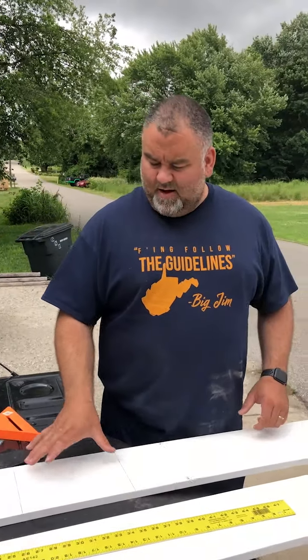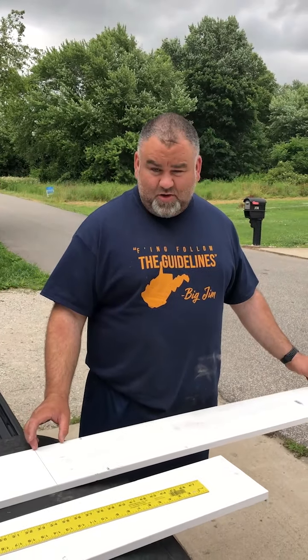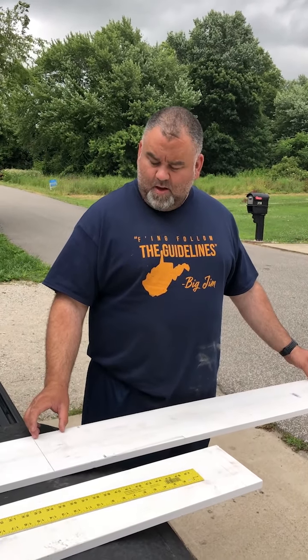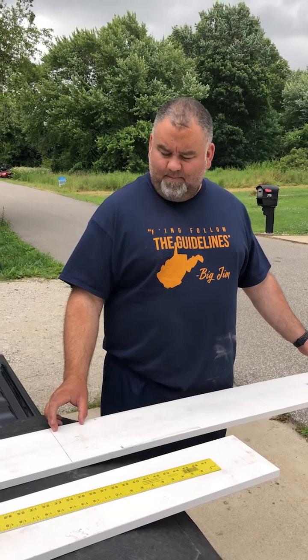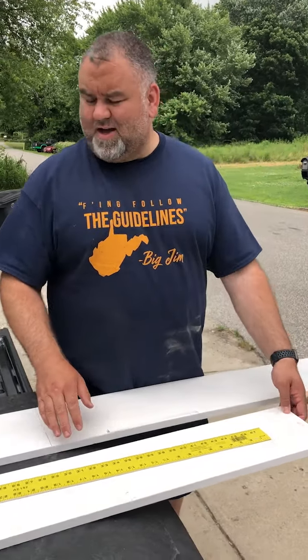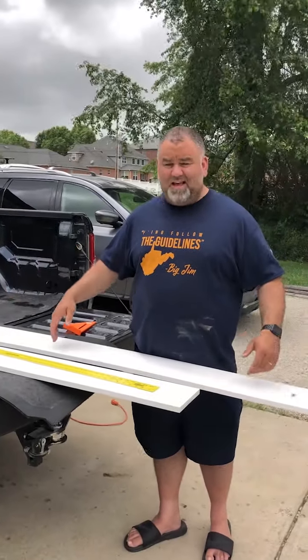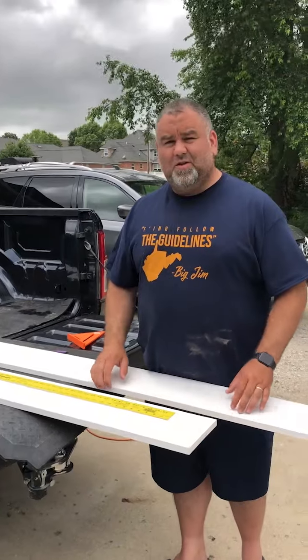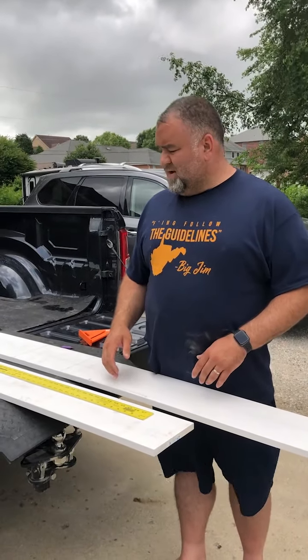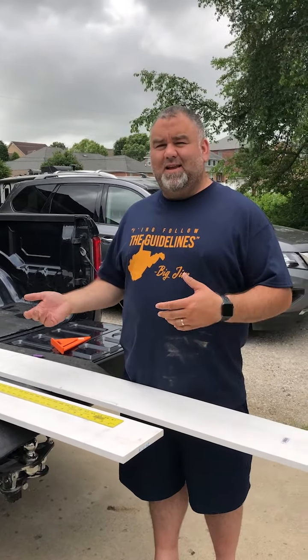It's pretty straight. Then I'll have a piece in the middle. About every 2 to 2.5 inches, we're going to drill a partial hole and put some little cabinet pegs in there so we can adjust our shelves as we see fit. We're not tied to anything. We're also going to cut some cross shelves about 30 inches wide so we can have two, three, maybe even four shelves in there. They'll be easy to remove so we can get to our inverter door — that's very important.